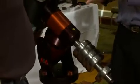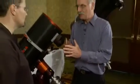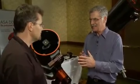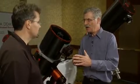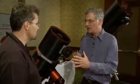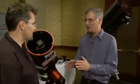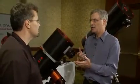So in other words, you've got the shaft turning an encoder. And this encoder's got very high resolution, with the computer looking at that encoder 100 times a second, and it's saying, is the shaft in the right place? And if it's not, you can issue a correction. So you can issue corrections up to 100 times a second to make this track. So that gets rid of all your periodic error. You've got precise tracking, but you can also respond to things like wind gusts, right?